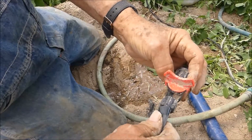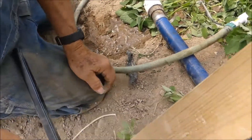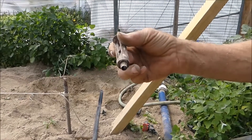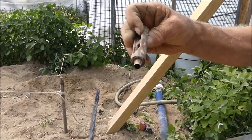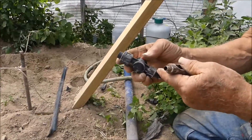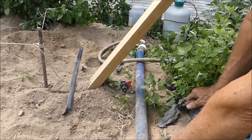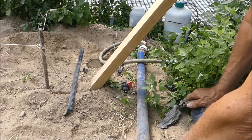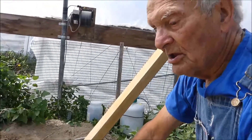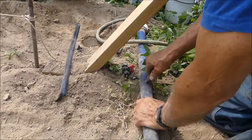It adapts on here, into this end. I have to drill a hole and put a fitting into the supply line to get in here. This is the little tool we use to cut the hole into the supply line — it's a very valuable tool because you've got to cut it evenly for the fitting to seal up well. This inch-and-a-half supply line is full of water at full pressure, probably 25 to 30 pounds. You can't really cut it without it being full because you're liable to damage the pipe on the other side, and usually you get at least one bath a day doing it.